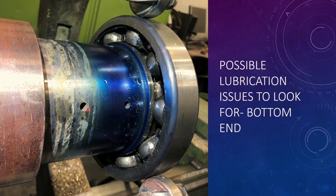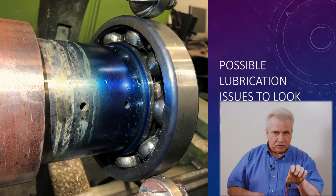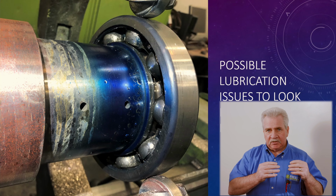It's going to actually suck air through the hole. And the bearing cap should have that large cutout that covers a hole in the end bracket that goes straight out to the outside of the motor so that it can take fresh air in instead of having the oil try to pull out of the housing.